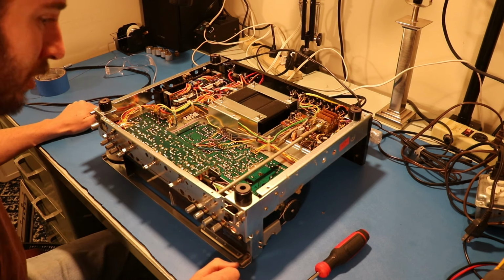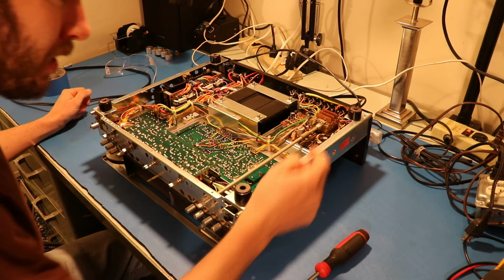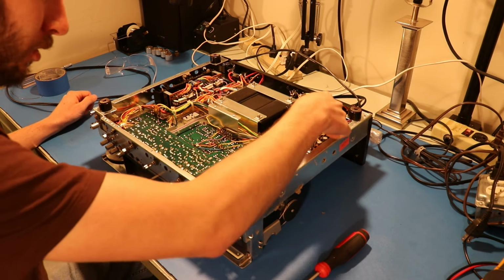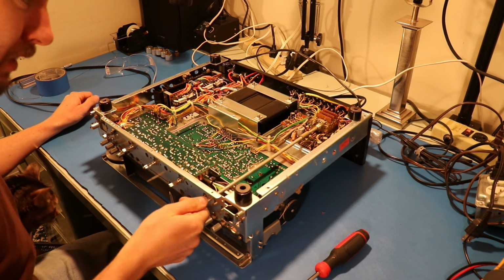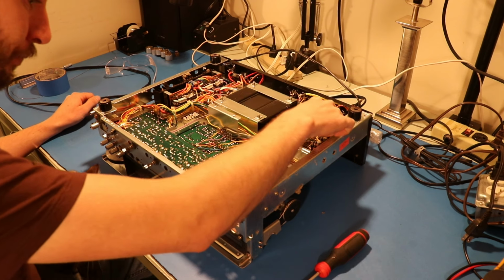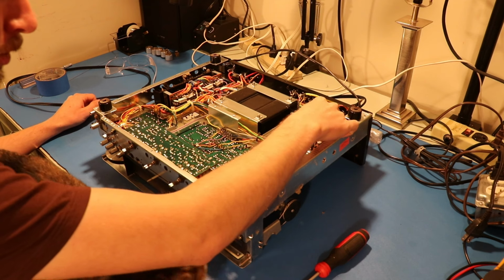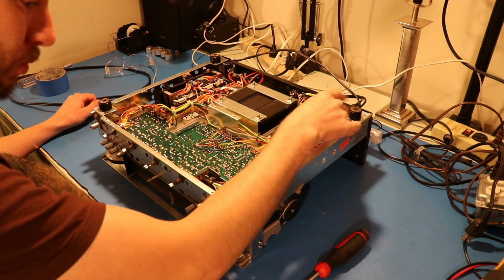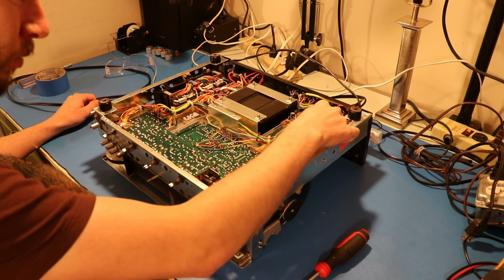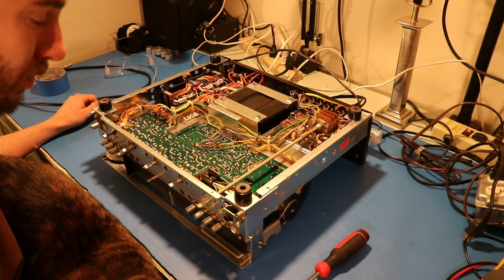I still feel better than what the Pioneers felt like. But yeah, we're under here, we can see now. Looks like this is something new that you'll see in the Gen 3s and later stereo stuff. They use these very long shafts to get to switches that they mount in the back, because it's a little bit easier for packaging. On the old stuff, they would have selector switches with little wires going to all of them, and you'd have to solder each individual wire, whereas with this, you can just put it in the PCB, solder the pins, and you're done. So much easier.